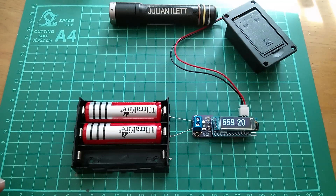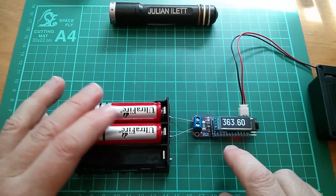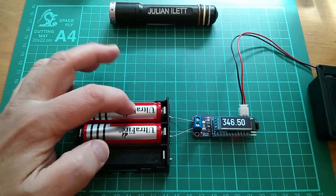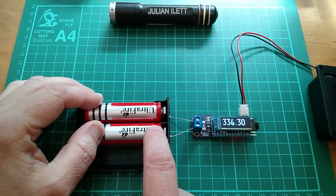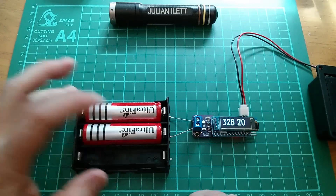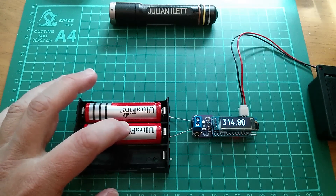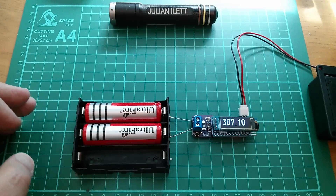So that one amp has dropped fairly quickly down to now half an amp. I'm going to have to put a new battery in there, but after another minute or so this has dropped to about 350 milliamps. So the current is being redistributed - the energy, I suppose - from the charged cell, which is the top one, through the current sense resistor into the discharged cell. And they will balance out. A current of 320 milliamps is being transferred between the two cells, and that will just continue to drop with a sort of exponential decay type curve. So this could sit there with current flowing between the two cells for quite a while.